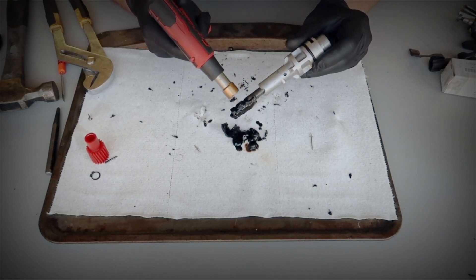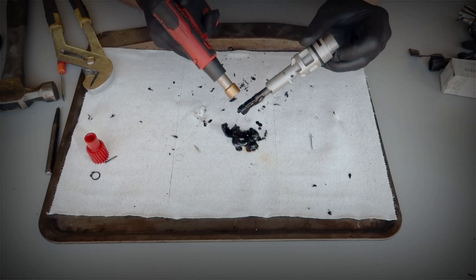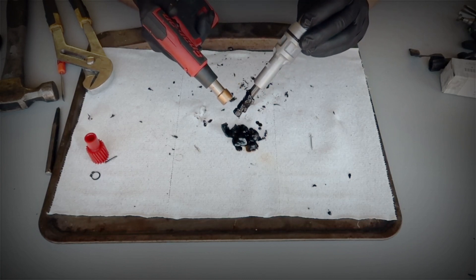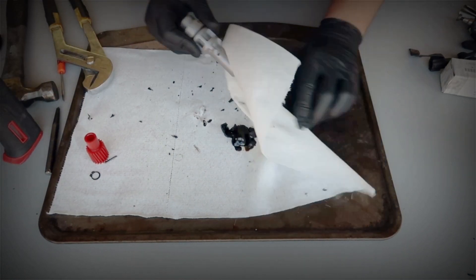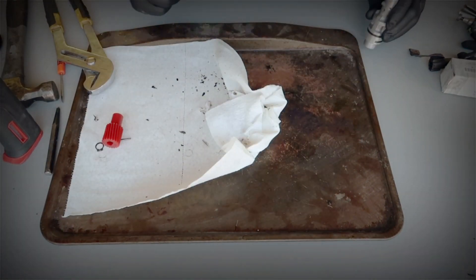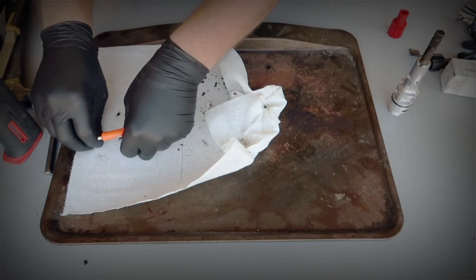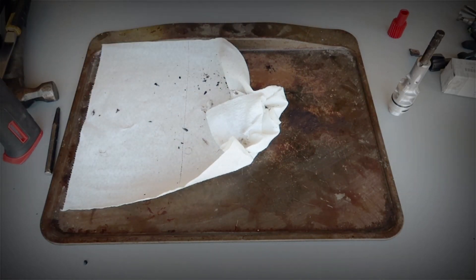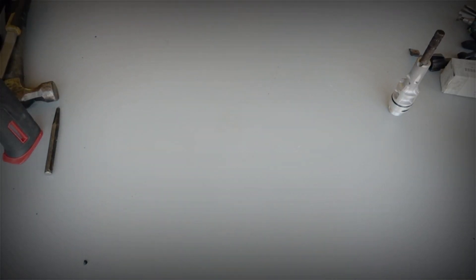Getting back to the sensor — as you can see most all of the wheel came off. You do want to heat it up. Once you get all the plastic off, continue heating for just a little bit. Then take a paper towel and wipe any remaining plastic off the shaft — it should come off pretty clean. The oils from the plastics should have already broken the bond between the plastic and the metal shaft, so you should have what looks like a nonstick surface on it if you've done it right. Then do a little housekeeping and get your work area cleaned up.